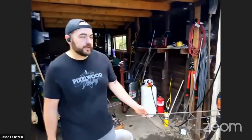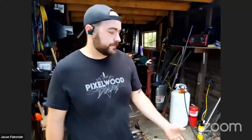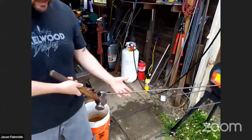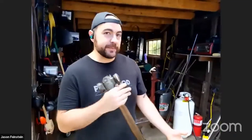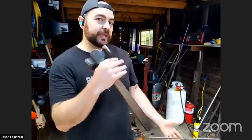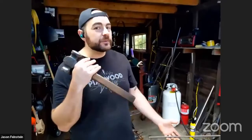We're going to wait for the metal to get up to about an orange color and temperature. Color translates pretty well to temperature for blacksmithing. It'll start off as obviously a grayish black color, goes into a deep cherry red, then transitions to more of a red orange, a deeper orange, and you get closer and closer to yellow. And then as you get into the really hot temperatures, it becomes yellow and it even will start to spark.